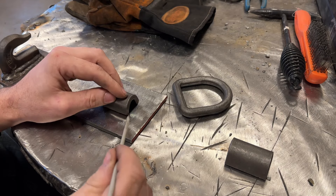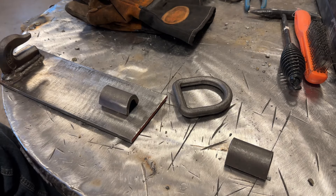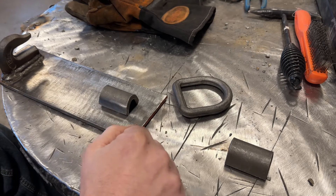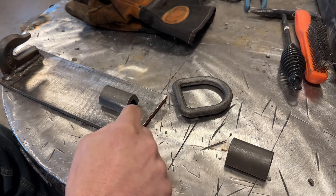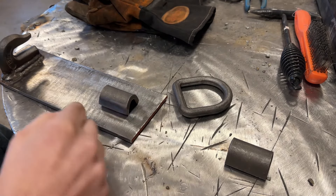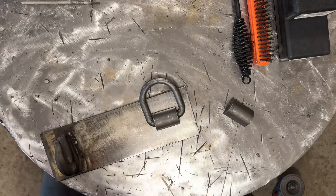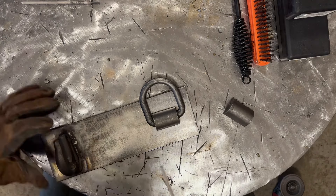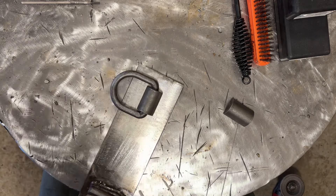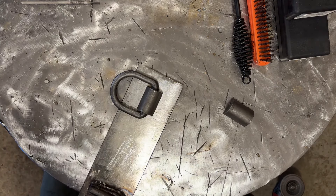I'll strike my arc over here and literally weld all the way down, then turn the corner and weld it. By doing a continuous weld that way I'll have a much stronger weld than if I just ran a bead in front and left the tacks - everything will be nice and hot and fused together better. So I'm going to tack this at 105 amps with 3/32 7018, running aggressive on amperage so the tack is hot and actually fuses in with penetration.